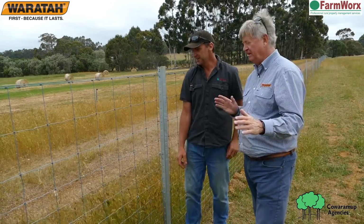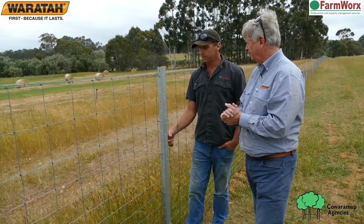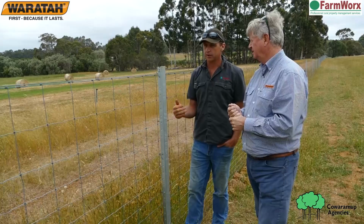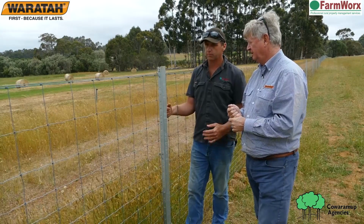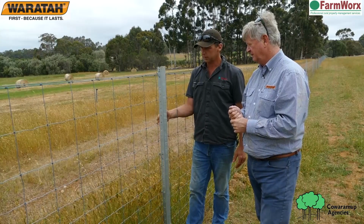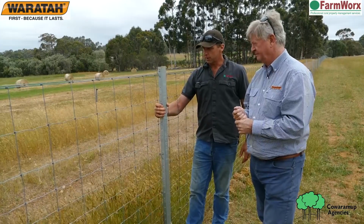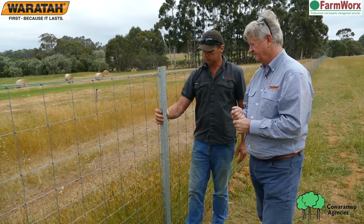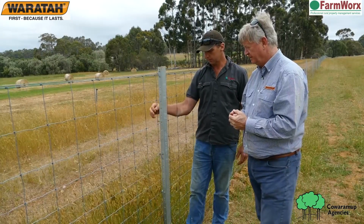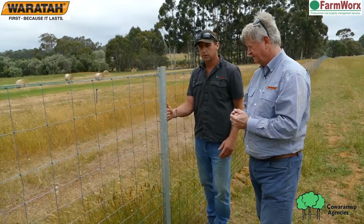So Simon, you've used the Waratah Geo and Geo Maxi posts. What, one in every three or five? The Maxi, we're putting one every 5, and our spacings vary depending on how much pressure there is between the posts. Your GeoStars, these are 2.1s, I think, so they're at 600. And these Maxis every 5th, and they're twice the size. It just helps add a bit more strength to the fence. Being a bit taller, there's more weight.